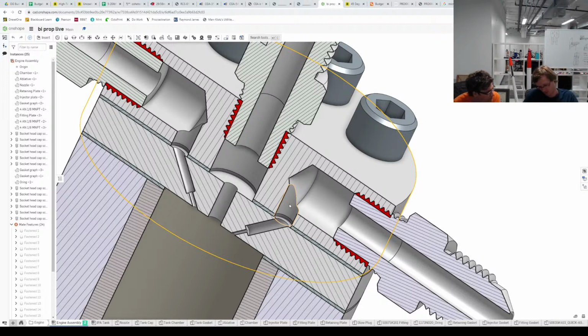Yeah, but like this is what I'm saying. If you look at the tap, you have up to there on the tap that is kind of almost useless. Up to, so wait, why is it that far? Just because, look at the threads. How that cutter works is... I can't speak correctly tonight. But they grind a taper into that so that you can actually start cutting threads in a hole.